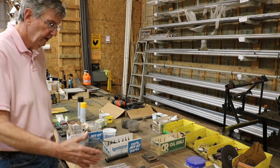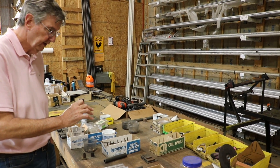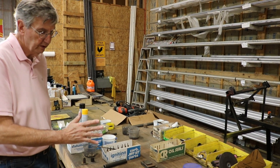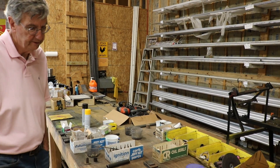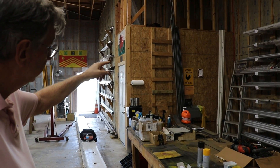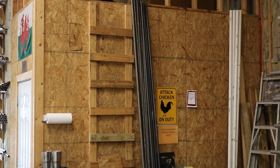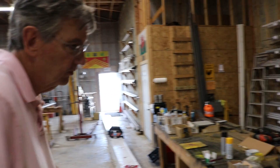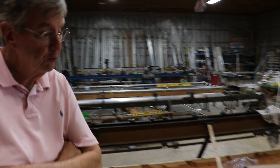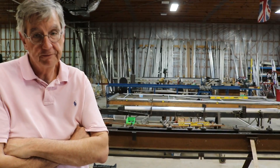When the gear systems are made by the welders, we then sand them and take away any of the welding burrs. We finish the work, and then we paint it. We order steel in very long rods, take them down, and cut them to size to fit the welding jig. All of this steel is 4130, and the wall thicknesses go from 032 to 058.